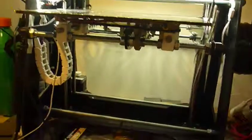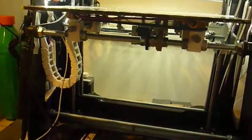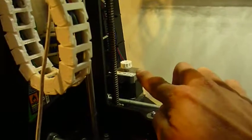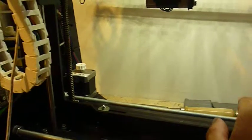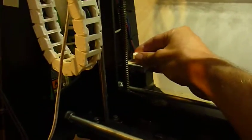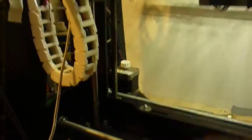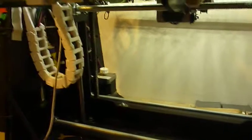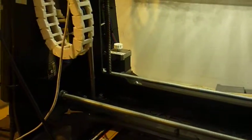How the Orca and many other printers have solved it is by also having two spindles on two sides, but driven by only one motor. There is a timing belt hidden under the bottom plate that moves the two rods together. The good thing is that while printing you can turn this motor and manually adjust the height of the first layer, which is very nice. The downside is that you need one more timing belt and some additional construction.